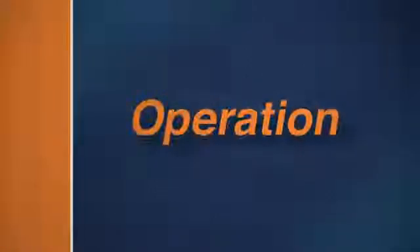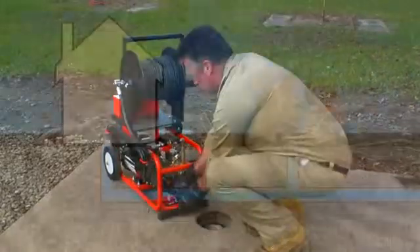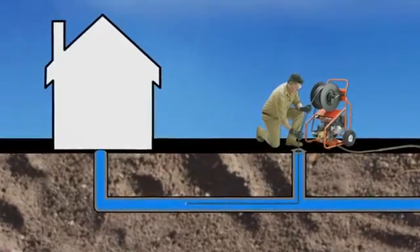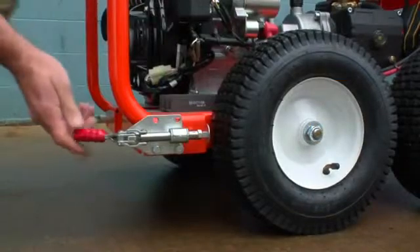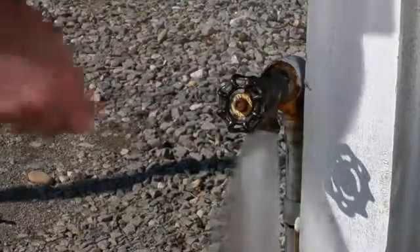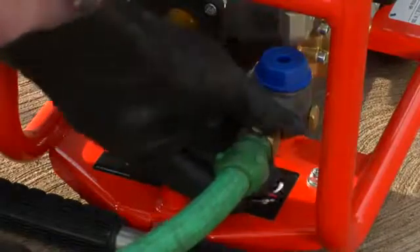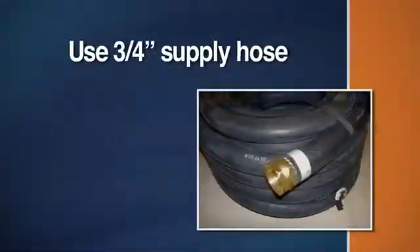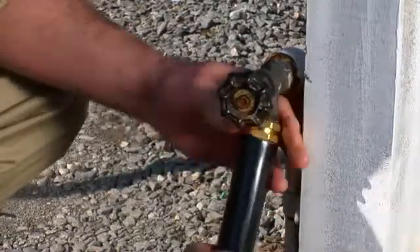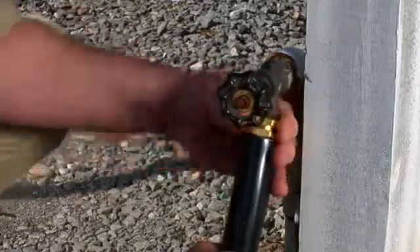To begin, position the machine several feet from the drain opening to allow enough room to work with the hose. Ideally, the line should be cleared from the lower end — that is, from the street to the building. Engage the brake on four-wheel models. Run the water for several seconds to make sure it is clear of sediment. Then connect the water supply hose to the inlet of the jet. Use a three-quarter-inch heavy-duty water supply hose to ensure enough water is supplied to the pump.